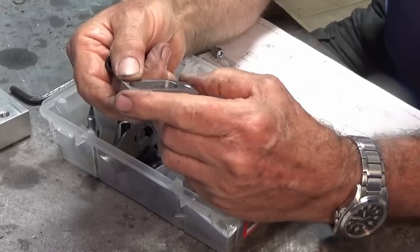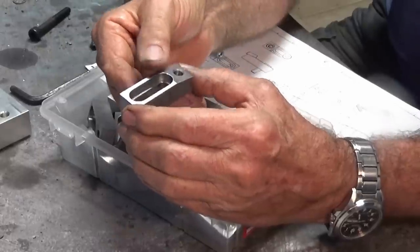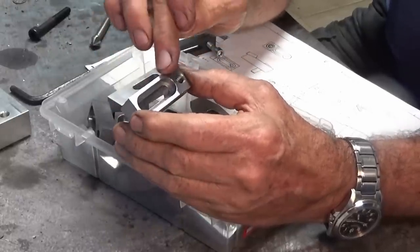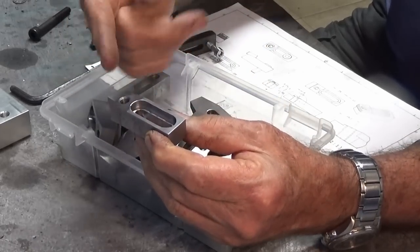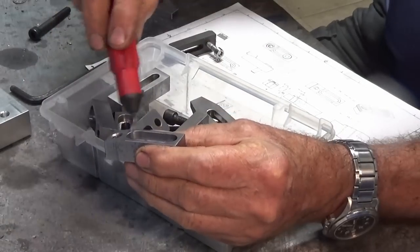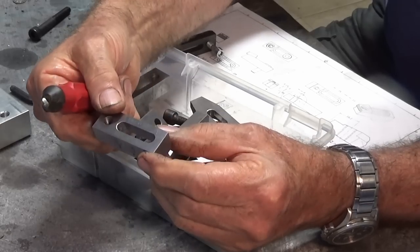And I just spent the last 2 or 3 hours grinding all these parts, or sanding them all, trying to get a reasonably smooth finish on all of the faces. I also deburred all the sharp edges, and getting around the inside of this slot top and bottom was really awkward. Ended up using a Noga deburring tool, went around one pass and I was able to clean that up top and bottom.